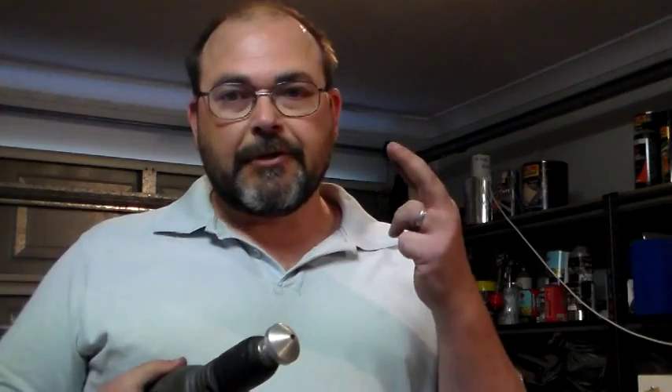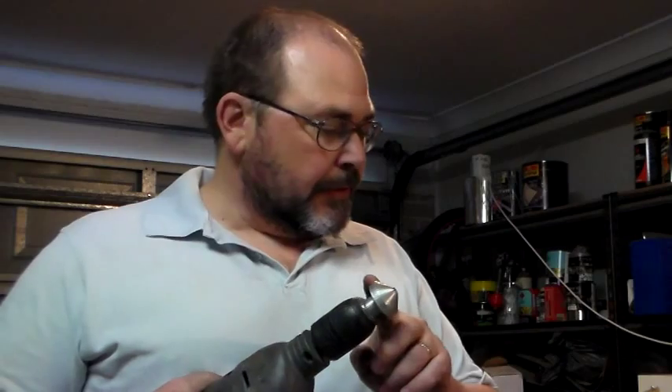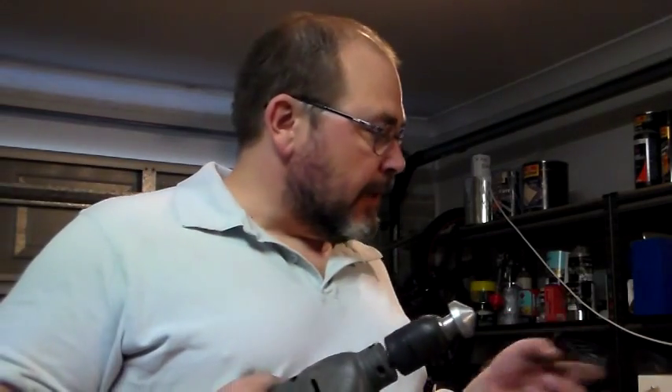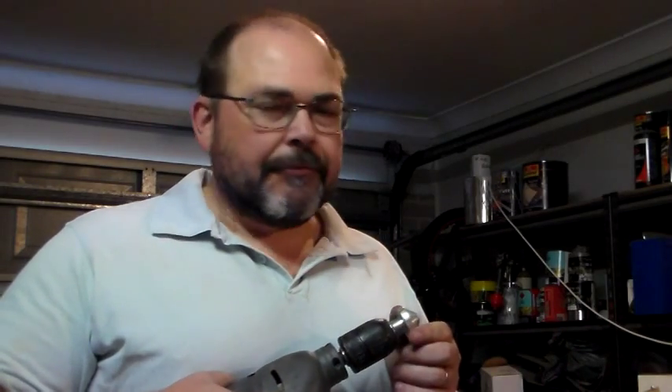So what I've done is I've mounted this in my hand drill. I'm going to try — I haven't tried this yet, so fingers crossed it works, that is DIY. I'm going to try running it against the belt sander and see if we can't turn this down to 27 and a bit millimetres to fit snugly inside the end of the injection module. I really don't want to have to run any sort of O-ring in there if I can avoid it — I'm just a little bit concerned with the fact that it's going to be getting to three, four hundred degrees possibly to melt the plastic and the effect that would have on the O-ring. If you've got any suggestions, please comment below. I'll take you into the sander and we'll get this done.